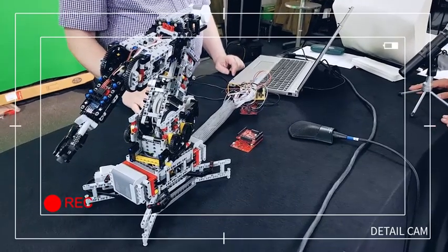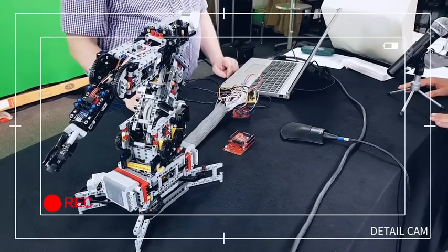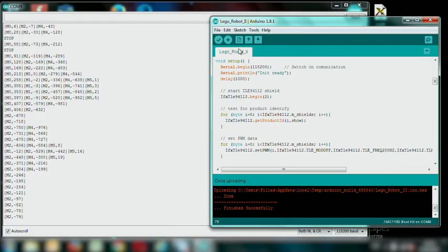There's also a seventh motor — a micro motor placed here — which can control the gripper at the front. For the programming: we took this motor controller shield, and at the same time Infineon also brought its new Arduino library. We used it here, so we can just use the ordinary Arduino IDE. With a little library from Infineon we could start and control the motors. The functions I've marked here are the starting function, which starts the robot and finds all the motors attached to the shields.